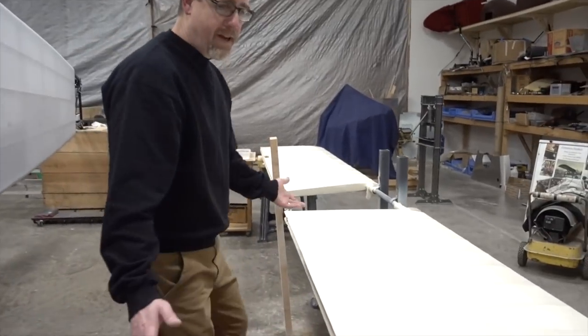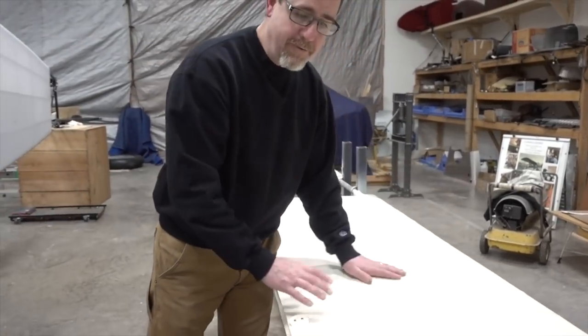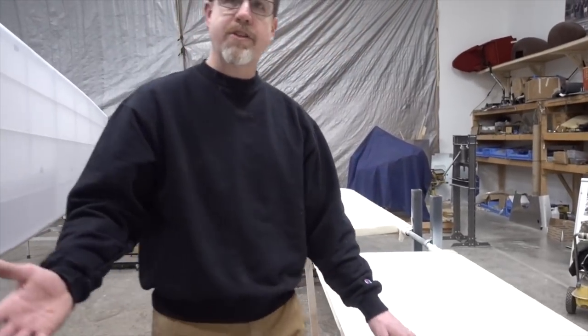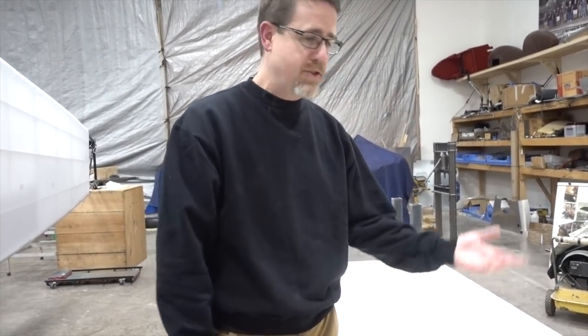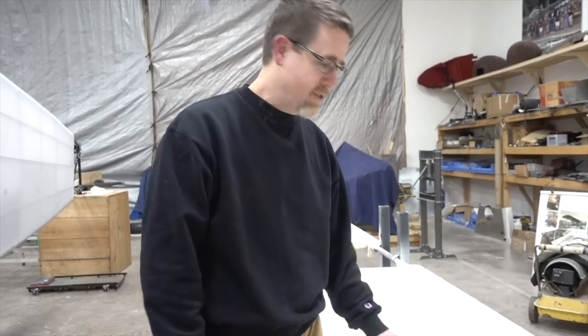These are the horizontal stabilizers. Now you'll notice this is kind of a cream color paint, if you will. It's a primer. And we're using the AirTech process on the Travel Air. There's lots of different paint systems out there and fabric processes that you can use: Superflight, Stewart, AirTech, Polyfiber, of course. You can still use dope on it. AirTech is my preferred choice. Everybody has their preferred choice and reasons why, but I like the AirTech process. It just gives us a really, really nice finish.